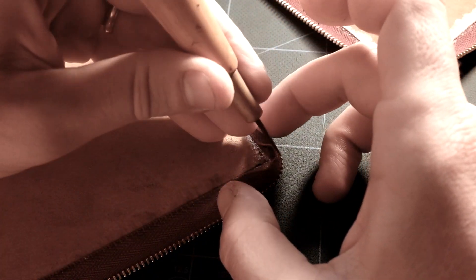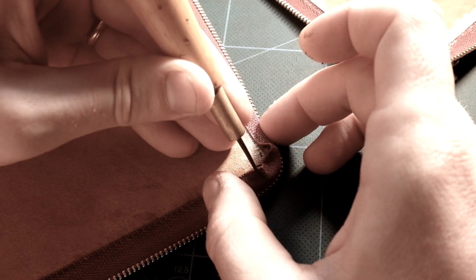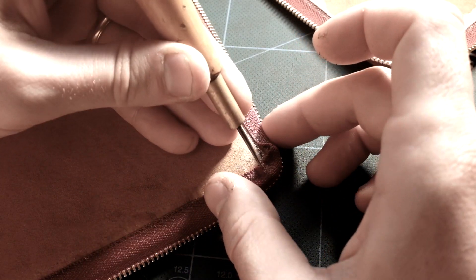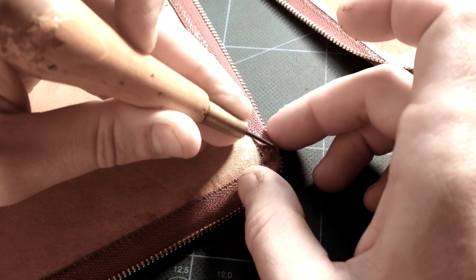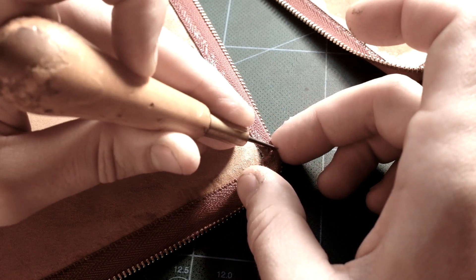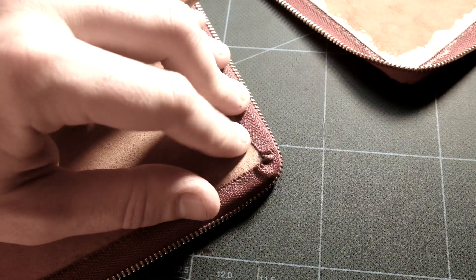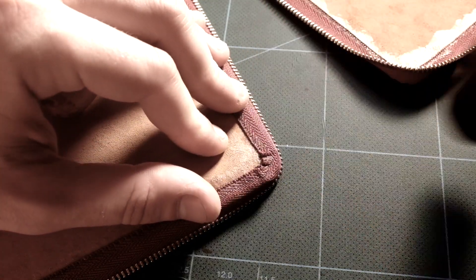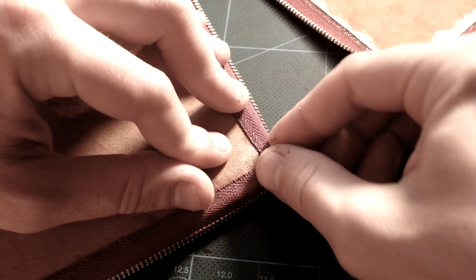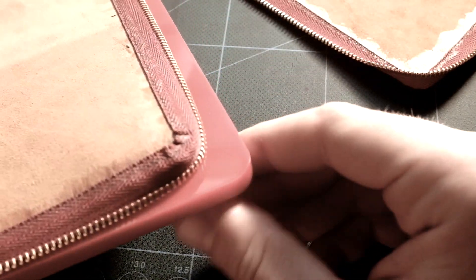As you can see, I am using a round hole to deal with the corners, and I am forming evenly distributed pleats that I will later flatten with a hammer. Underneath, I am using a mold — trust me, this makes the process a lot easier. A small acrylic mold is sold with the acrylic version of this pattern; check the link in the description.